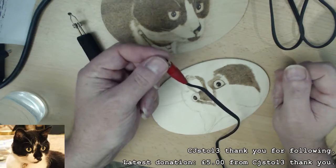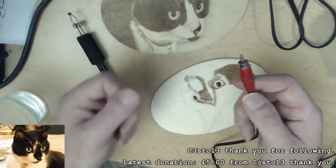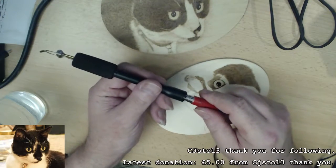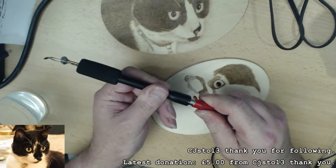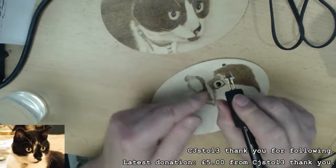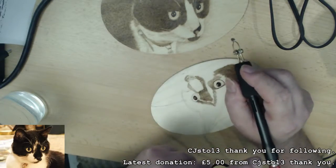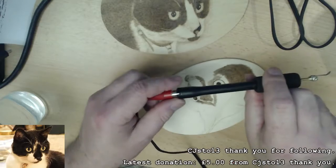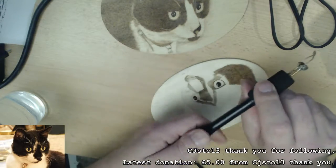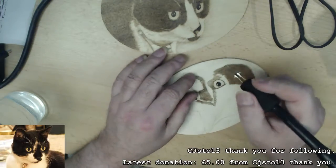These are warm. In fact, they're quite hot, and I'm going to have to let go shortly. But I'm not getting electric shock or anything. They're warm actually because they are not making as good a contact as they might, and that creates resistance, and it's the resistance where the heat comes from, and it should be down here. I'm losing heat because some resistance is being created here, which is making it hot. So I shall have to look at that and adjust those contacts a little bit later.